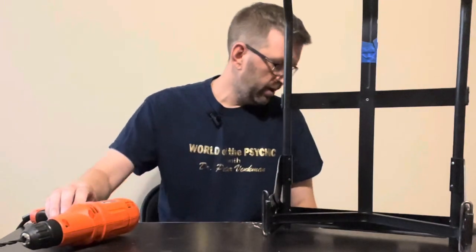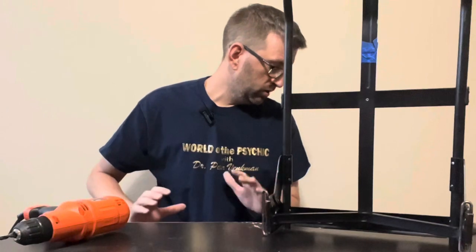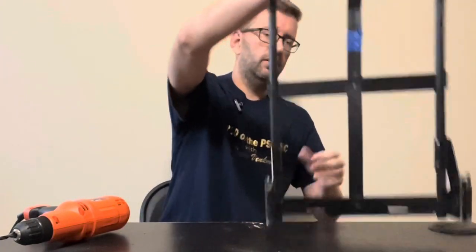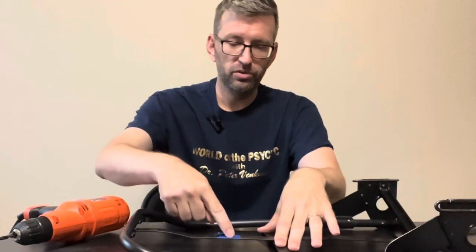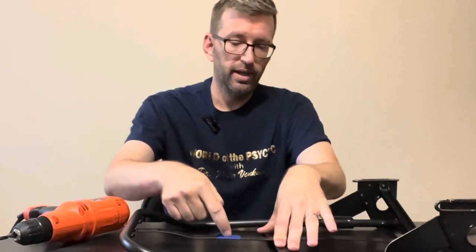I have my drill ready to go. I'm using a 7/32 drill bit and then I'll put a 1/4-20 bolt through that hole, so it will be pretty tight. I might have to use the bolt to loosen it a little bit once drilled, but I'd rather it be tight than too loose and wobbly. There's an indentation that runs right down the middle of the frame, so the drill bit will naturally try to find its way to that spot — that's why I'm drilling from this side. As long as I keep it on the line I drew, it shouldn't be off-center.